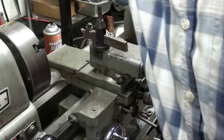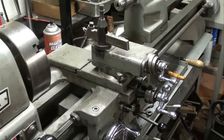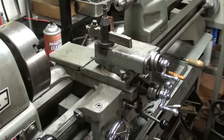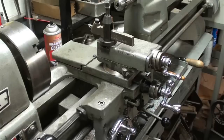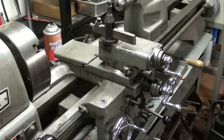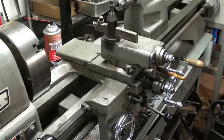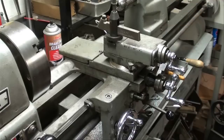Let's reverse it. It's very important to remember that when you turn your main spindle motor on and off, this power feed is still moving. If you haven't disengaged the feeds and you walk away from the machine to the telephone or whatever, it's possible that you could crash the lathe. So I need to remember to either disengage this or to turn it off at the yellow control box. Now let's do some cross-feed.